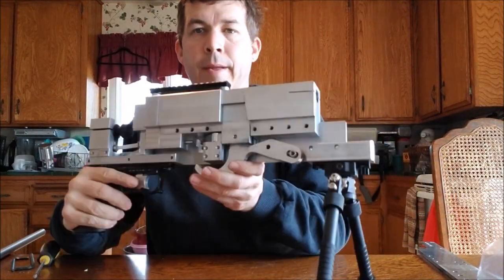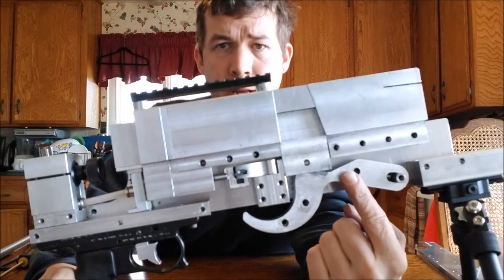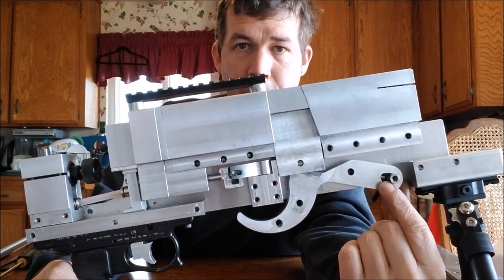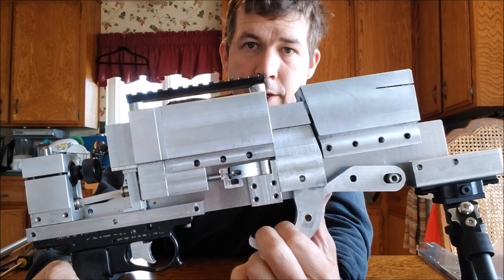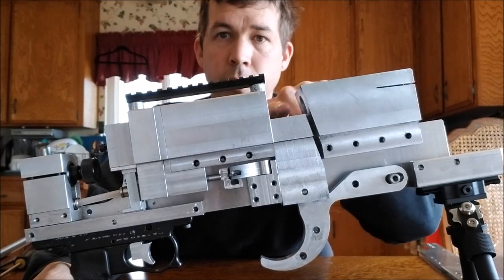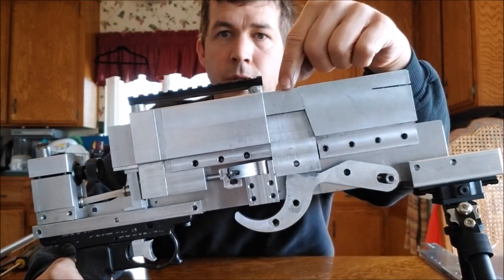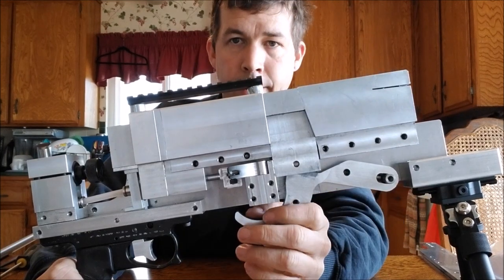The charge handle has an offset angle — when it's up, there's a spring housed right in here. There's a little button that gets pushed against a pin, and when I pull the lever down, the distance between here and the centerline gets shorter, creating pressure against it — you can see it compressing. That's what holds the block up into this taper. The taper is machined so the block fits cleanly into it. When I push it, it slides up and locks in. There's also a hole drilled through this block from one chamber to the other, slightly angled upward because the barrel sits higher than the centerline of the chamber.